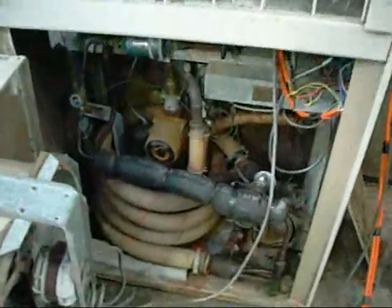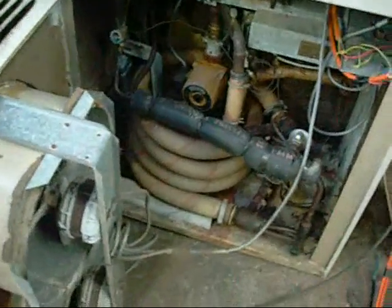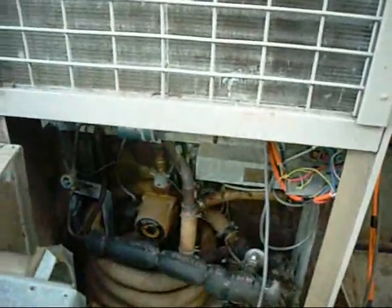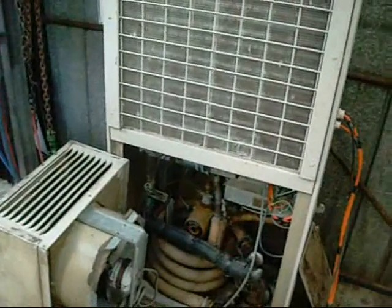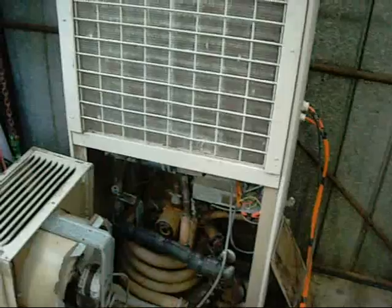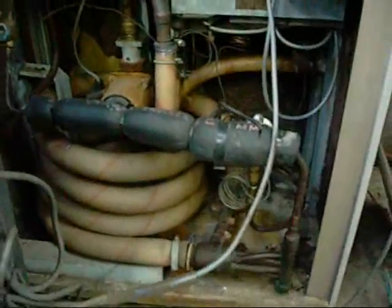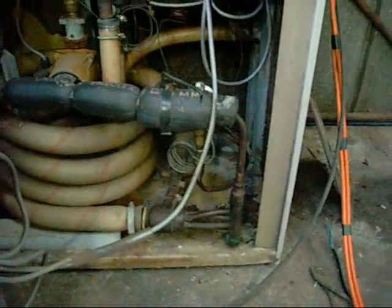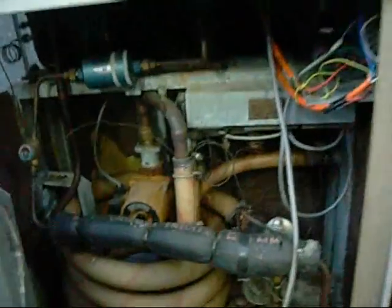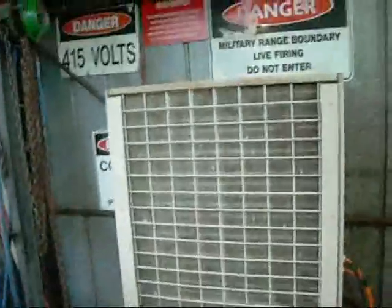It's got full control monitoring inside the cabinet — it won't ice up or do anything silly without one of these clicking in and shutting it down. It will keep that coil constantly cold and as soon as the call for cooling is made it slams the pump into gear. Very low downtime, very quick temperature rise time. And the funny thing is there's no reversing valve — it's cooling only. That's why they didn't just pipe refrigerant into the building. It's not a heat pump, just a cooling unit. Kind of neat.